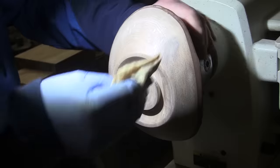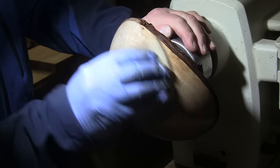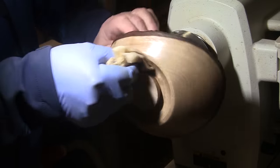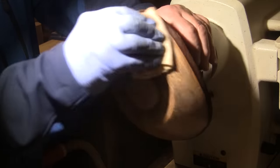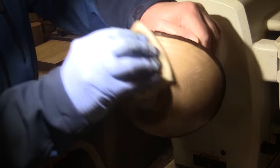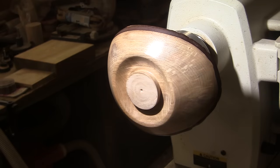English walnut — got some nice flecks in the grain there, and of course that bark enhances the color. This is sanding sealer that I'm applying — shellac based sanding sealer. I'll put on 2 coats of this and then 2 coats of shellac. It's pretty chilly out here, about 42 degrees, so I had the piece spinning slowly on the lathe with my heater pointed at it to warm it up a little bit, and that really helps it absorb the sealer. That's the first 2 coats; then I'll put on 2 coats of shellac and we'll start working on the inside.